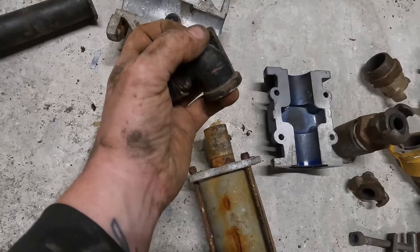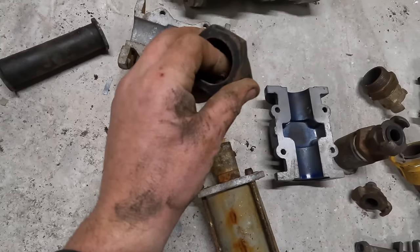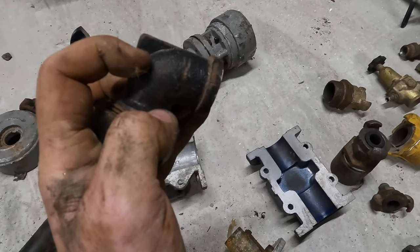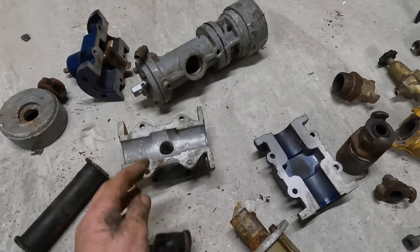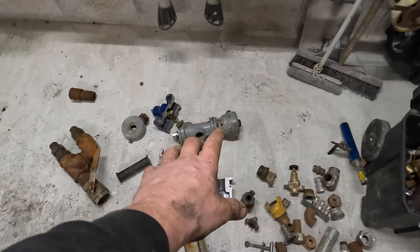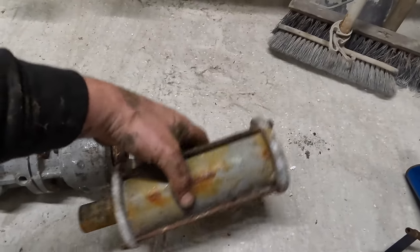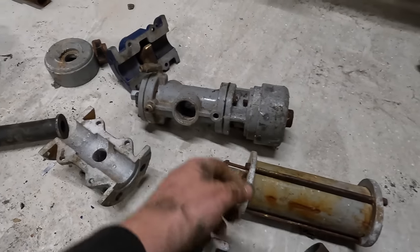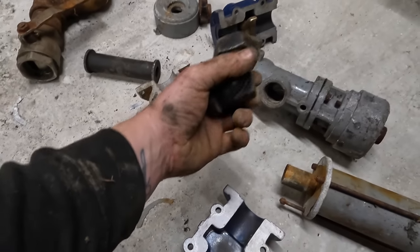See, that's got that bit of weld on the end there, that extra bit of metal on it. That's for when original blast pots blow off and exhaust at the top of these. It'll blow into there and it wears that corner out, so they put that piece on there and it makes them last longer. Still, they don't last that long. It would have been better if it weren't a 90, because they try to make it all compact, but thinking about it, they could just screw it on that way. I know then it's probably going to exhaust straight into your face, but that'd probably work the other way around anyway. And something as simple as putting it so it's facing down and doesn't have that corner on it would eliminate that fault that it's always going to have.